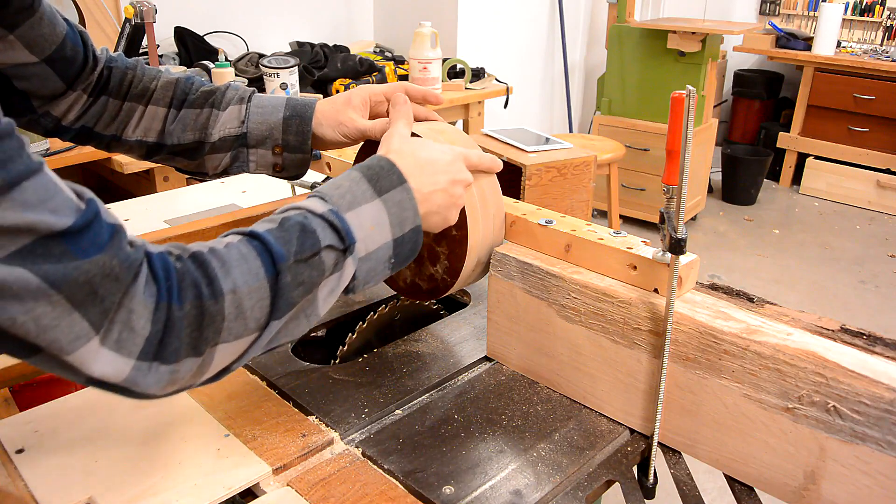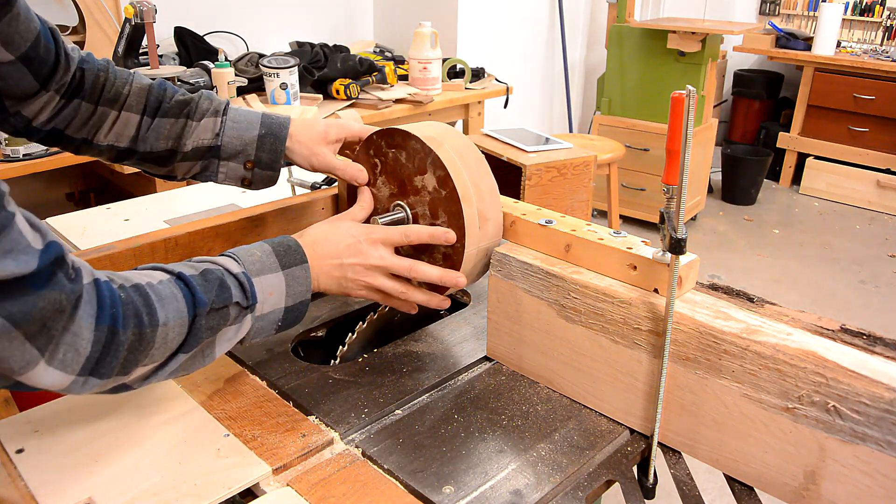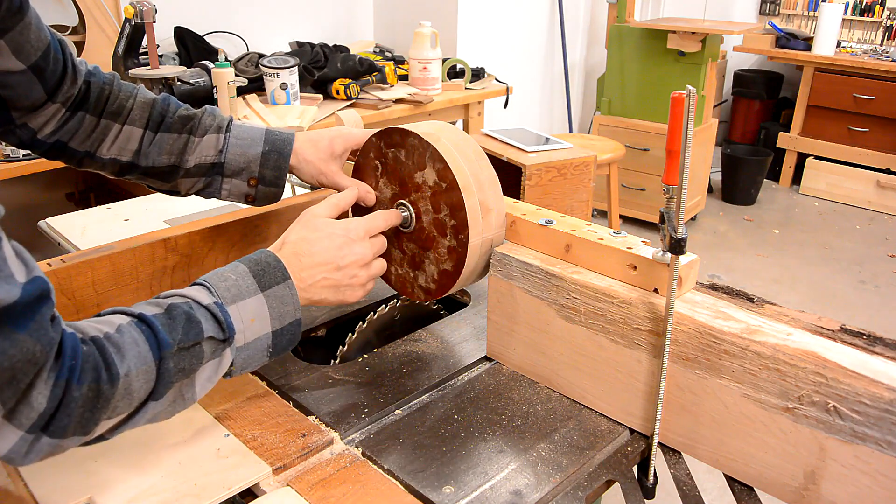To get along here I'm actually going to slide this along the shaft, and that makes sure this surface is going to be parallel to the shaft.